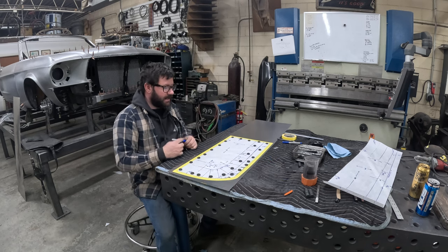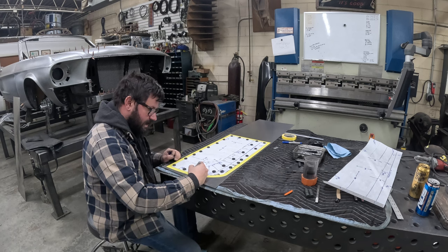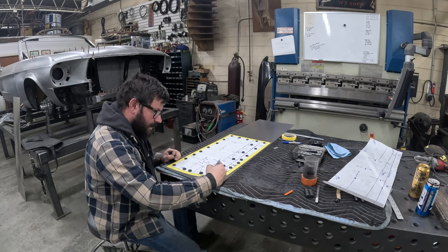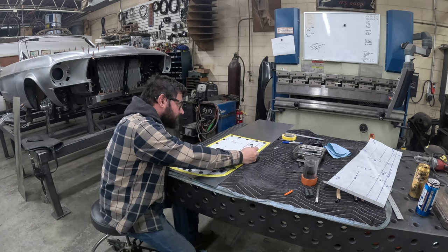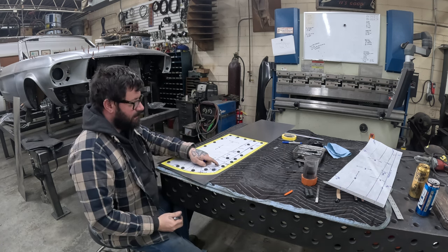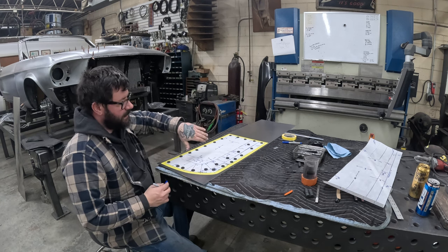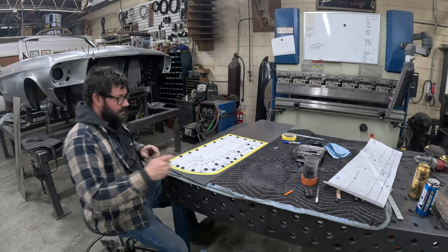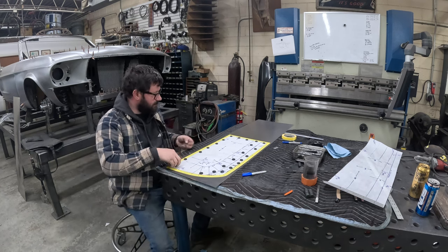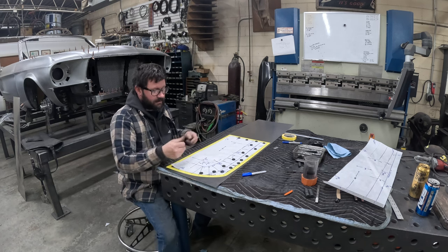So the only other thing I need to note before we pull that off is I am gonna just draw on our tape here where the bottom of our shrink marks are. And we'll also have to come back because there's a little bit of stretch here. After we do our initial shrinking, we're gonna have to stretch that flange back out, but I'll lay that out later. So right now, we can pull our pattern off, and I'll do a quick zoom or a pan across